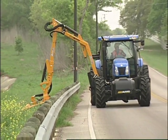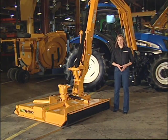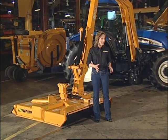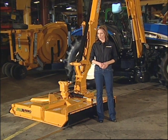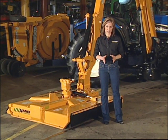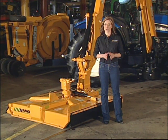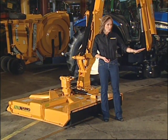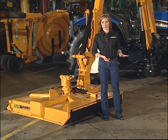It is important while you mow to control the stability of the tractor and boom mower, especially on slopes. If the unit is operated on slopes greater than 5 degrees, additional counterweight is required. Operation on slopes greater than 11 degrees is not recommended under any circumstances. Know the limits of the tractor and soil. Make sure the ground is solid below the tires before extending the boom. If you feel the soil could give under the weight of the tractor tire, do not extend the boom. If the boom is extended and you feel unstable, slowly lower the head to the ground, then draw it into the tractor until you can safely raise it again. If the tractor does tip to the right, the boom and head will act as an outrigger and will normally prevent rollovers. If this happens, stay in the operator's seat with your seatbelt securely fastened, power the unit down, set the parking brake, and phone for help. Do not move without assistance.